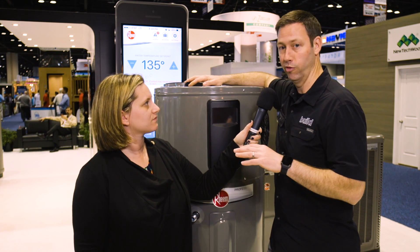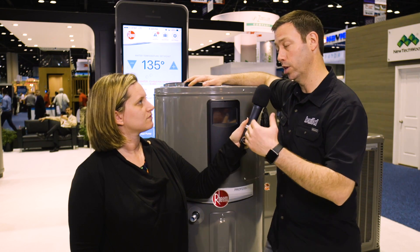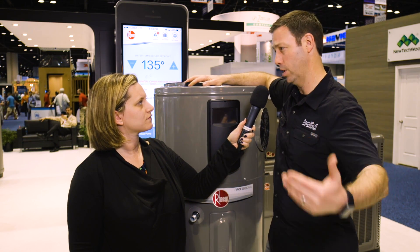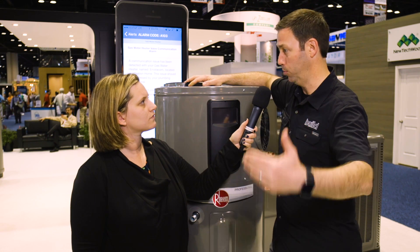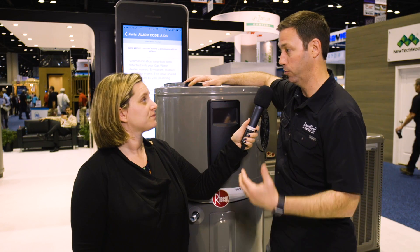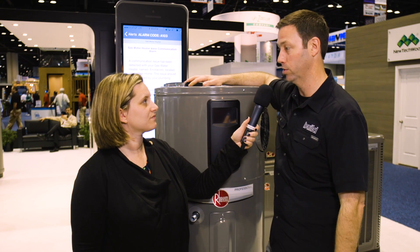This is pretty legit at 3.5. When it comes to power, it's also going to give you more hot water. A standard electric tank is probably like 60 to 70 gallons of output in the first hour. This one can pump out 80 gallons. So it's even more powerful — it's going to heat faster than a standard electric tank.